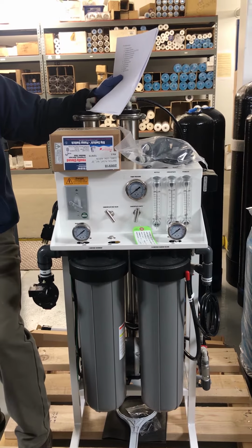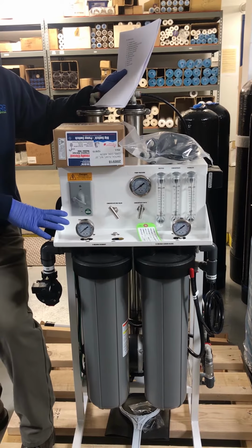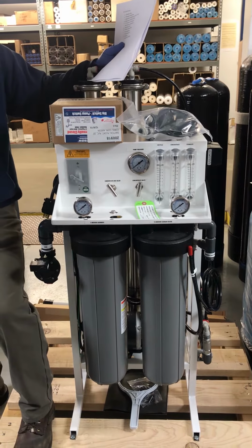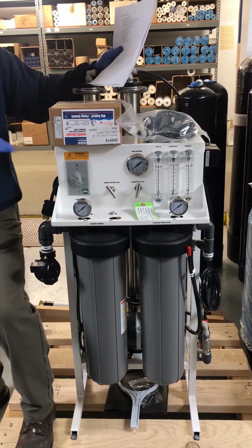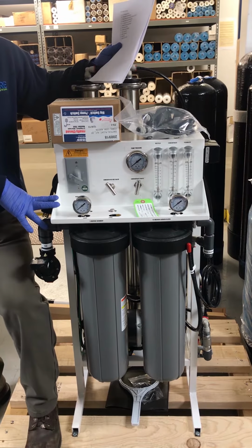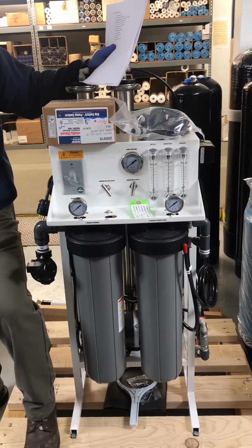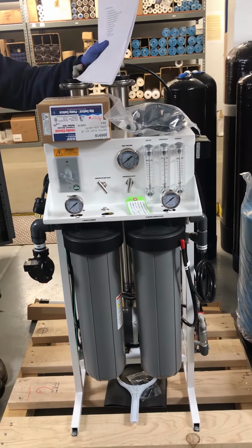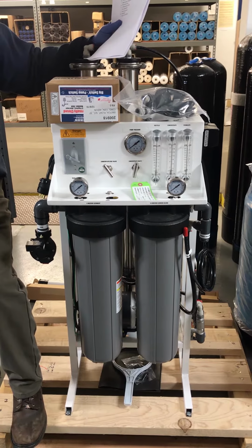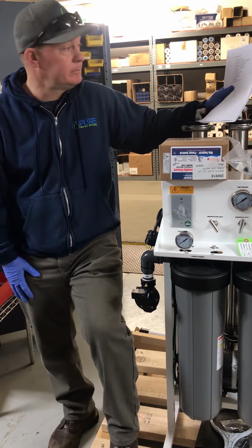We're not, typically. I mean, there may be a time when we install one of these at a brewery or in an industrial application. It's on city water, and we'll be able to operate these 1-to-1, no problem. But on Virginia City Highlands water, we need to put about 1.5 gallons down the drain. So for every gallon you make, you're putting 1.5 down the drain. It's about 7 to 8 tenths. If it's making a gallon. Yeah. They're not making a gallon. They're making about 7 to 8 tenths. Okay. And we're talking 800 to 1500 TDS water. Lots of garbage in the water, lots of trash in the water.